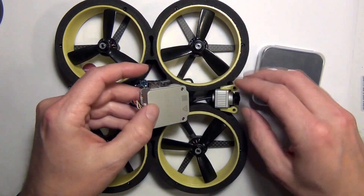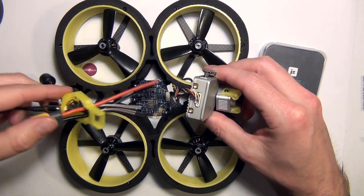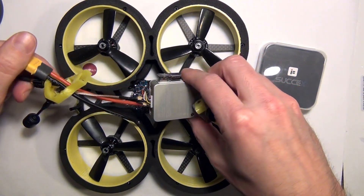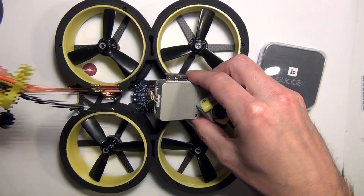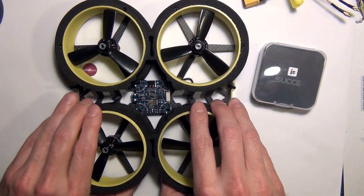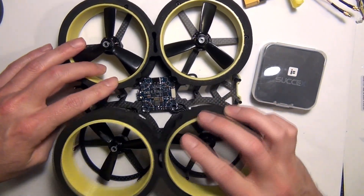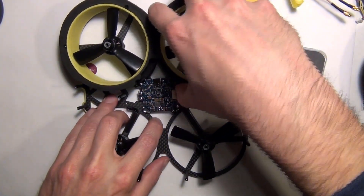This plugged into the pin header there — you can remove this piece. Of course, we had the connectors for the battery leads, and then these were plugged into the back of the DJI air unit for the antennas. Get those two things removed out of the way. From here you can take these ducts off — those just slide up out of the way. There's a duct on each side.